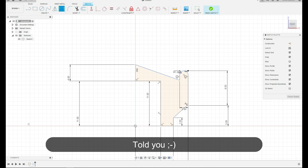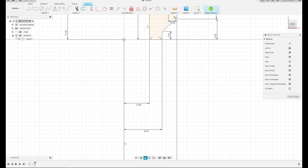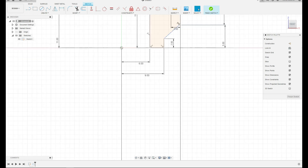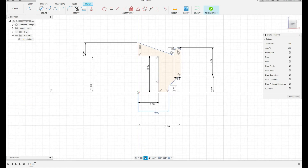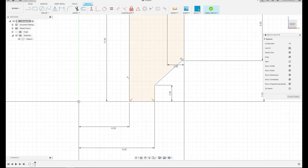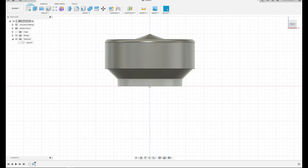We have nine and 12.5, so this small part here was about 0.5 millimeters, and three by three in this corner. Finish sketch. At this point I actually printed a first model of the part to make sure all dimensions are as they should be, and it fits. Then I added the knurling — the ribs on the side to improve the grip.